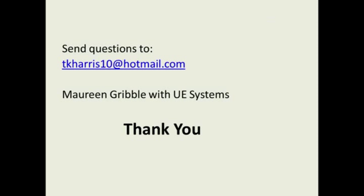Well, that's a real good question, and I'm glad you brought that up, because to me it's just as important to understand these principles for your own vehicle if you want it to last a long time, just like your plant equipment. But you're right, the Jiffy Lubes in those places do not follow these procedures, and many of them are using the cheaper oils that are high in particles and high in other contaminants. When you go in there, what you want to ask for is the synthetic blends or the synthetic oils. Those oils are much cleaner than your standard mineral-based automotive oils. Some of your synthetic oils will probably be about 5 to 10 times cleaner than the standard mineral-based oils.